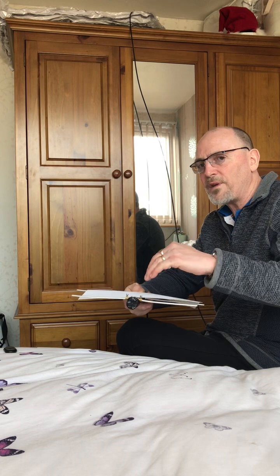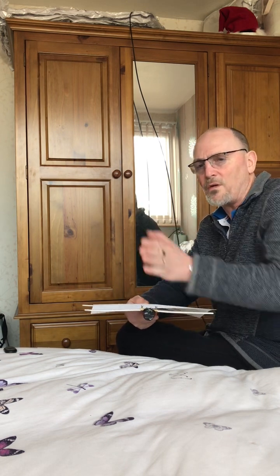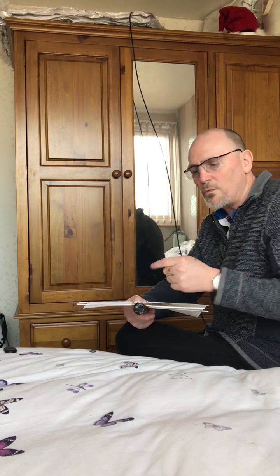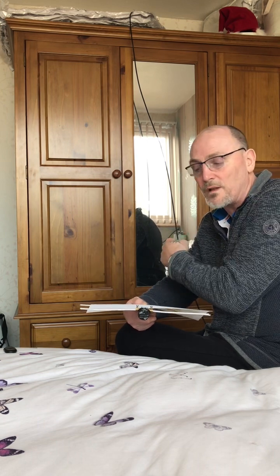But don't forget, 50% of our power is going the other way as well, which means if we're talking forwards to our friend and there's somebody in a different town behind us, we are going to be interfering with him. He's going to be able to hear our transmission as well.